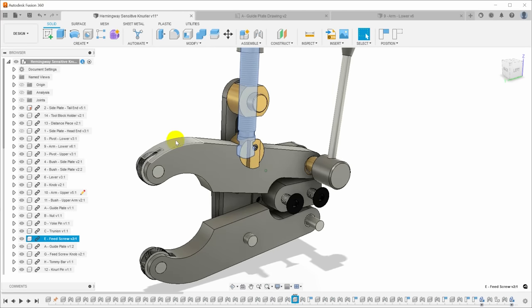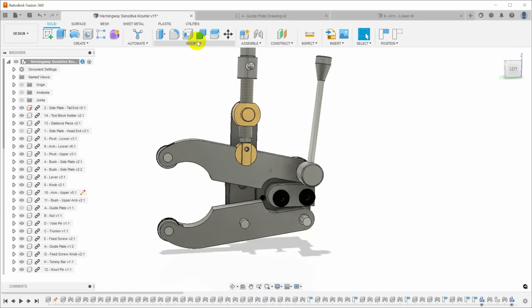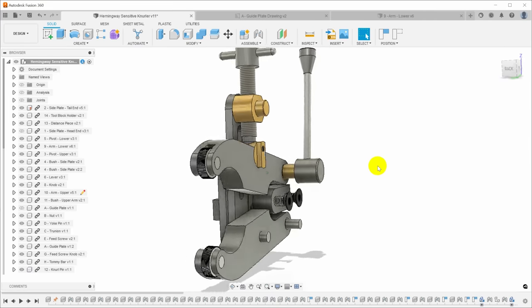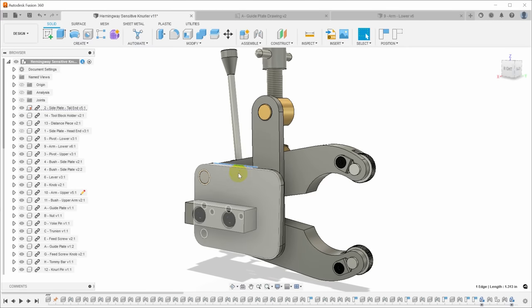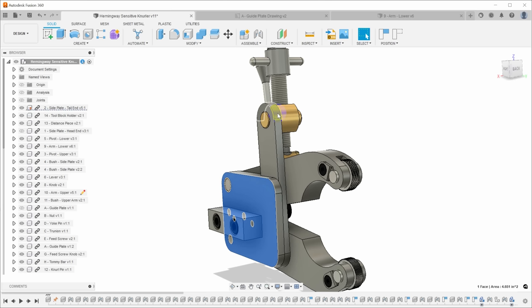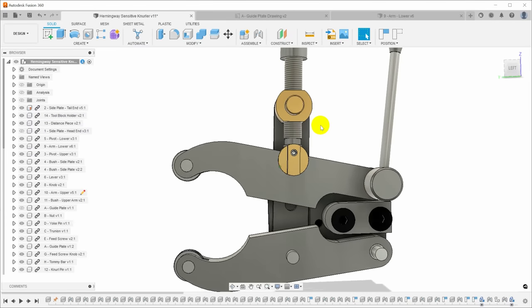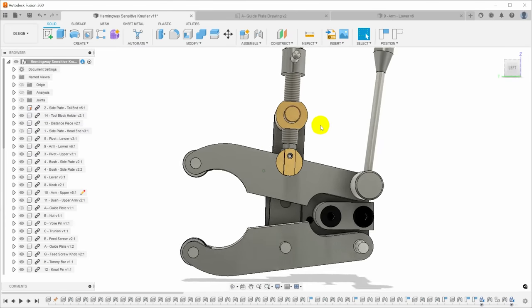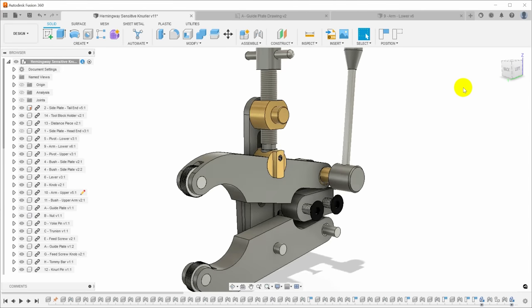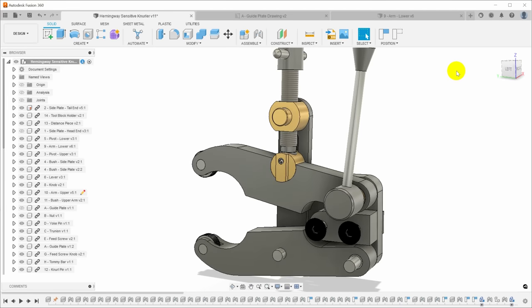There are a lot of curves on these parts, and that's the primary challenge in machining this. Starting with rectangular stock, my plan is to machine all the basically rectangular flat bar parts without putting any curves on them - leave them square, leave the ones with rounded ends long. We'll drill and ream all the holes in the correct locations, then come back with the rotary table to round all the ends and machine all the curves at the same time.